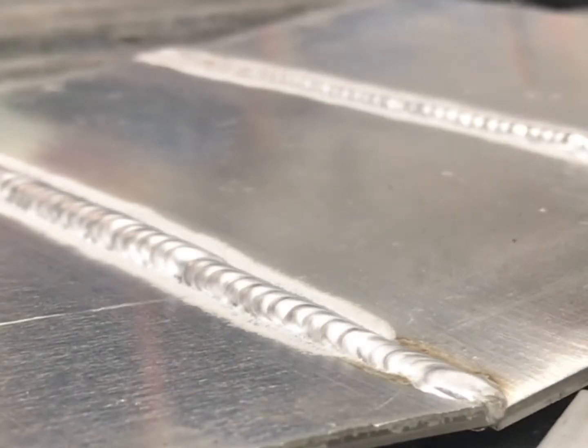It starts to sink. And actually, if you just keep welding at that same temp, look at the back of it — you're going to find out where your weld went. It's actually going to go through and pop out on the back side. Here's another image where you can see I'm definitely hitting a moving target a little bit, but not contaminating. I'm just about an eighth of an inch off that base metal — it's not rocking too much where it's contaminating.